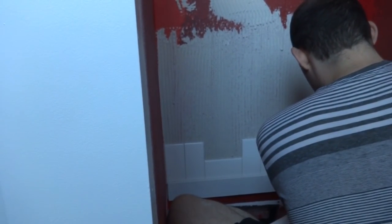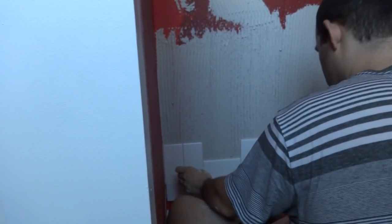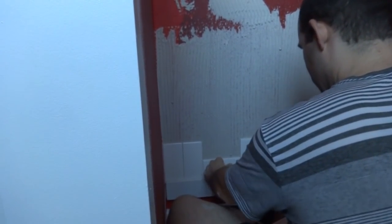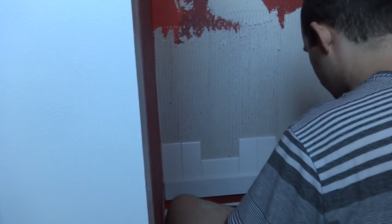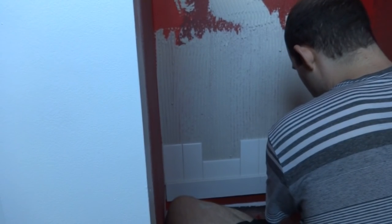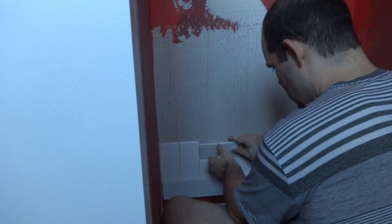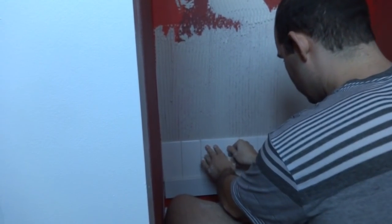Continuing to set tiles. Make sure they're squished on real good — I'll put these two in here. Just double-check there's no excess mortar squeezing out. I want to wipe that off — you don't want that to dry, so dig into it and get it out, because you want the grout channel there, not mortar.